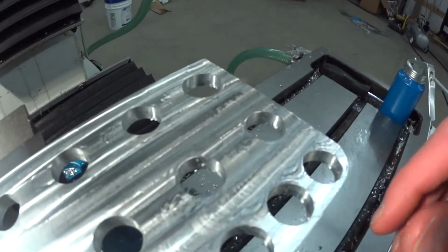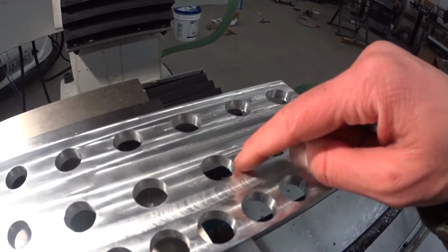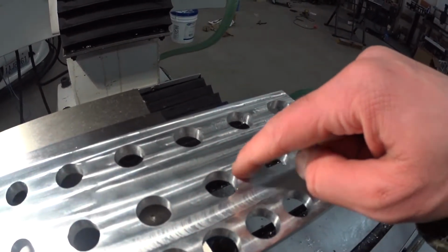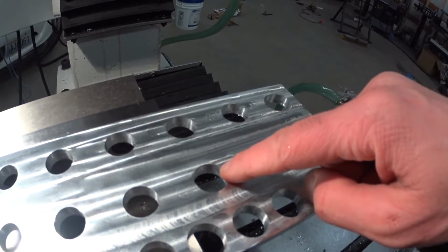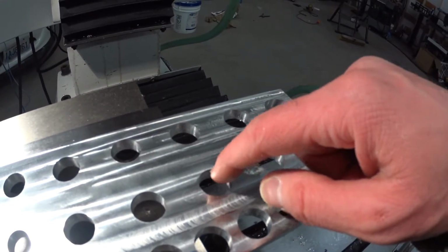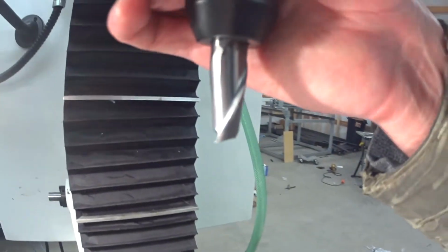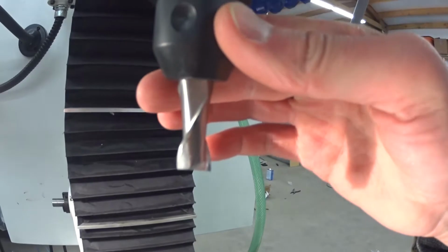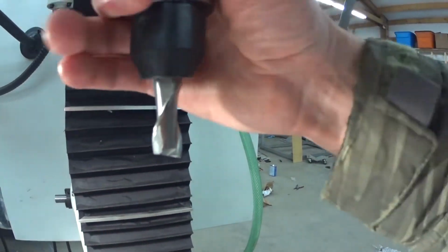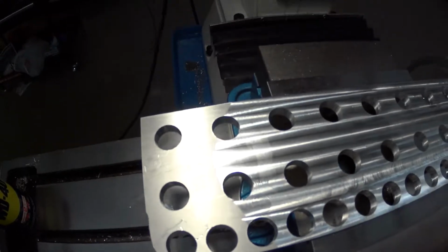And I'm going to try to get those cleaned up so that the tool holders will slide in, because I dimensioned, I'd have to look at the drawing to be sure, but I'm pretty sure I dimensioned it at 0.76, which the top is, but the bottom is coming in at 0.72 for some reason. And it's not like this is a tapered end mill or anything. The head should be trammed, but either way, I'll keep playing with it.